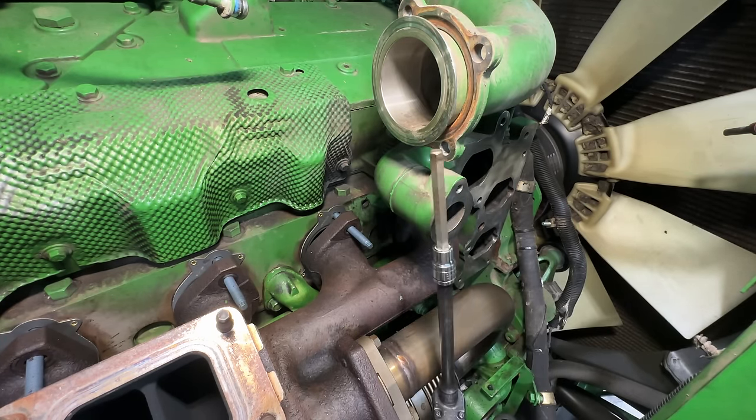All right, they're all torqued to 18 foot-pounds. I run through it twice because I want to make sure they all stay at 18. You'll notice when you go back through the second time, you got to tighten some of them some more to 18. So I want to make sure they're all staying at 18. And then we got the Tech Angle set up at 90 degrees. So I'll show you one and then we'll blaze through it.